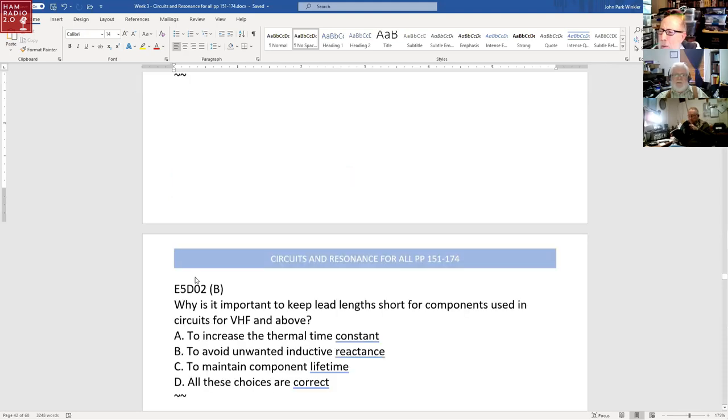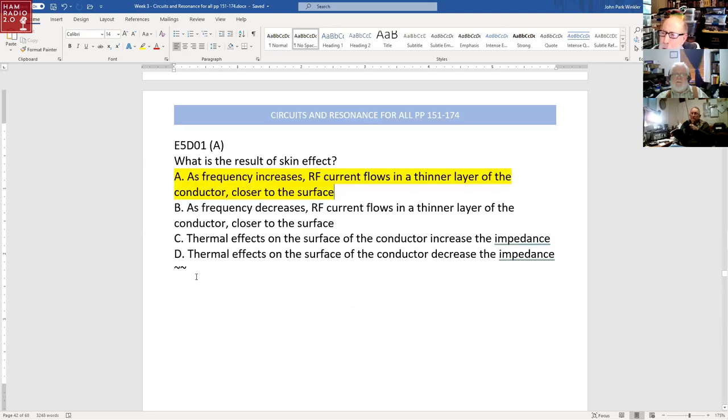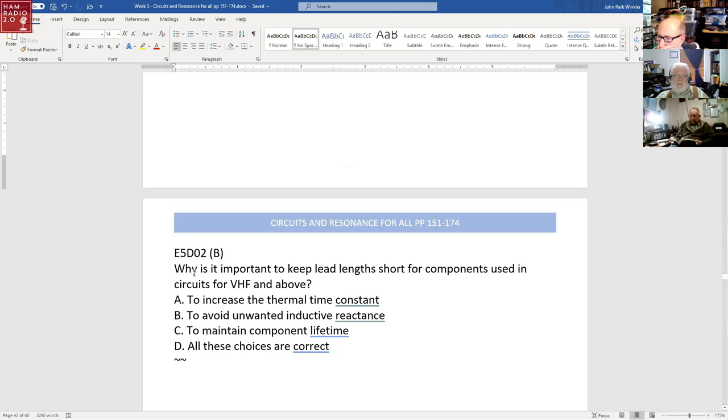If you have a half dipole antenna, what would the difference be between using stranded wire or solid wire with the skin effect? The stranded wire probably would have more loss than the solid wire, but both are used in antennas. It's probably not enough to worry about, way less than an S unit, maybe a dB or so or less even, between stranded and solid.